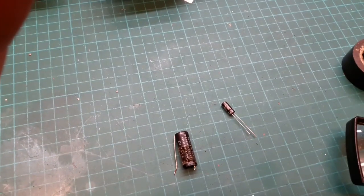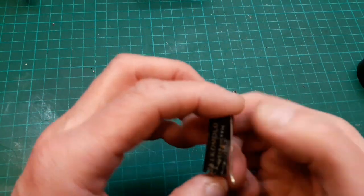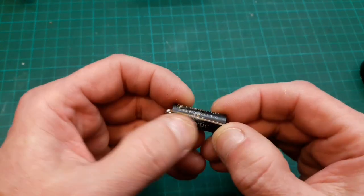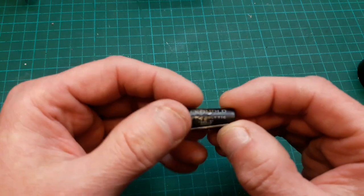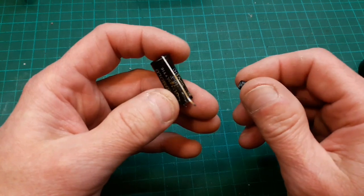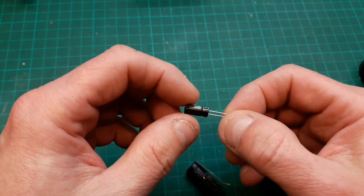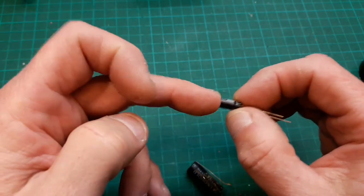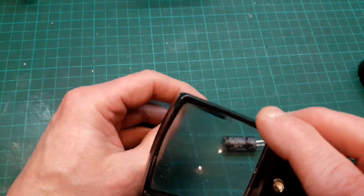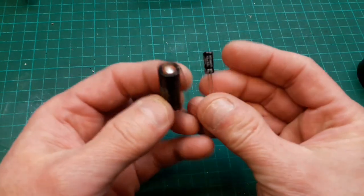Whoop. Where have we gone? Here we are. Okay, just getting a bit closer there. So we've pulled this Elcomode TCC cap out, and it is a 10uF cap. Here's its replacement, which is a 10uF cap, and this one's at 50 volts. They do look nice, these things. I pulled it out really cleanly. Well, this one's at 50 volts as well.